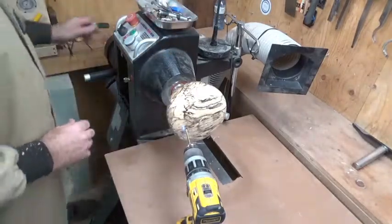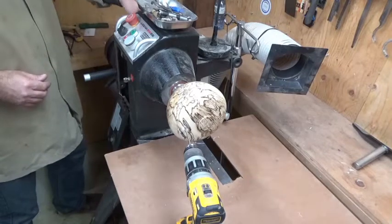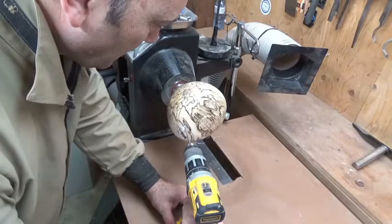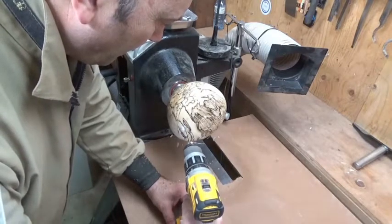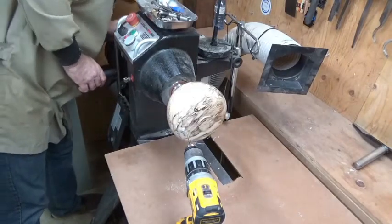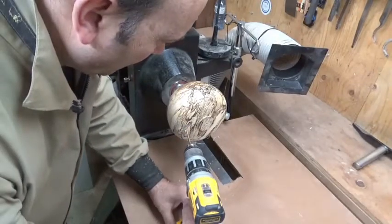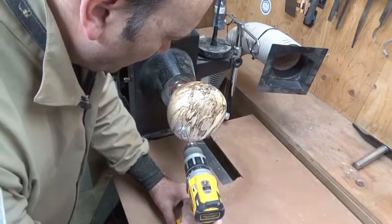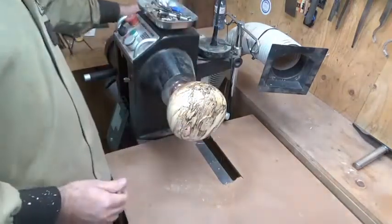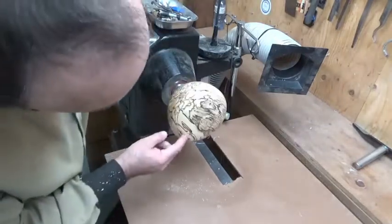Okay, now I'm going to move the spindle. Now I'm in position 13. And 25, locking that into position. And that is my three holes drilled, taking the indexing locking pin out so that it spins freely now, and you can see my three holes.